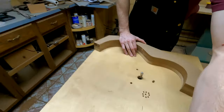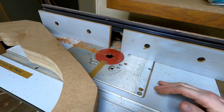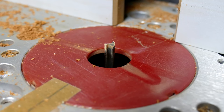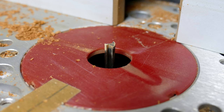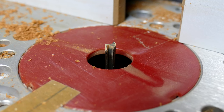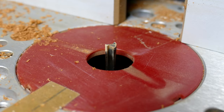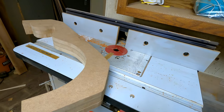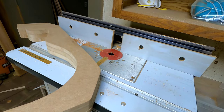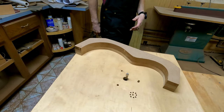Here, I'll show you a straight cut bit. This right here is a straight cut bit. The blade's just going straight up and down, so when it encounters the wood, the full height of that blade just goes thwack right into that wood as it enters. For that reason, the bit is much more stressed and more inclined to kick that piece of wood back at you, if, for example, you presented it with a little too much material for it to eat. So with the spiral bit, you can get away with a lot more, and I like that.